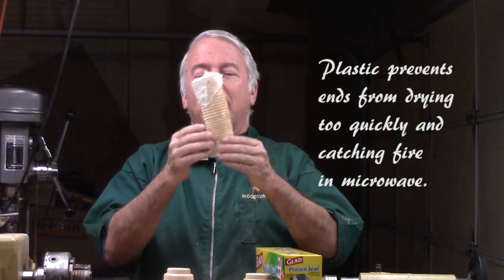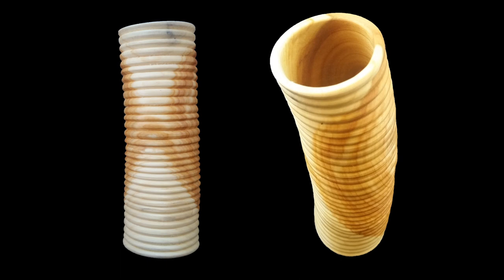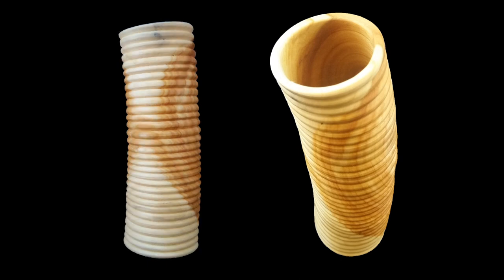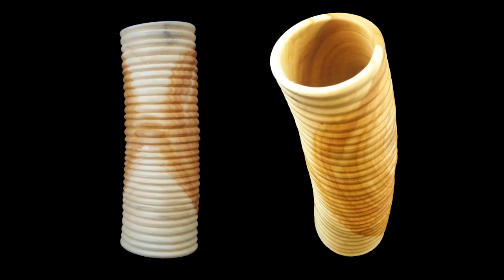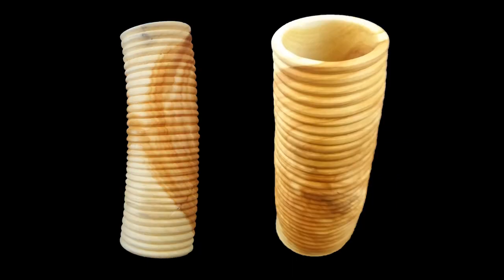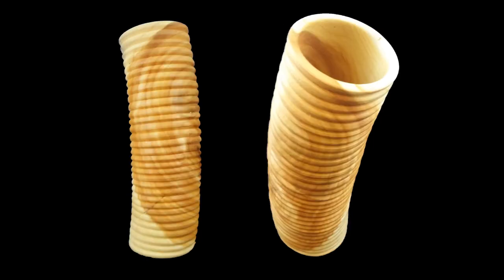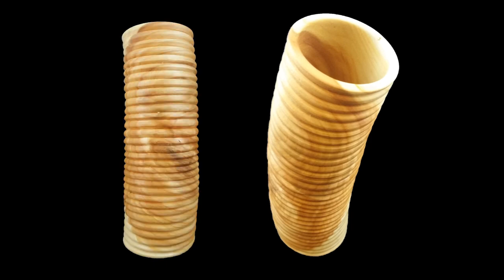So here it is — tube, natural warp. I like it, I'll do some more. Sam, here's my tube out of cherry with some nice warping and distortions. This cherry seems somewhat calm and stable. Next time I would not cut a tenon on the open end of the tube — instead I will use the shark jaws to grip the exterior. The steady rest saved this project when the tenon failed; I'll use it again next time.